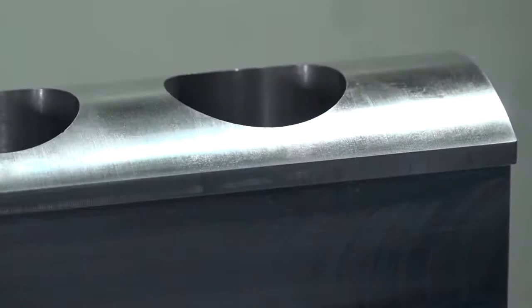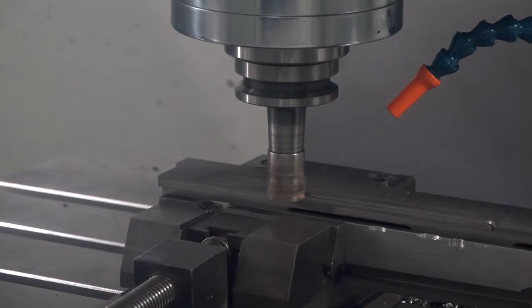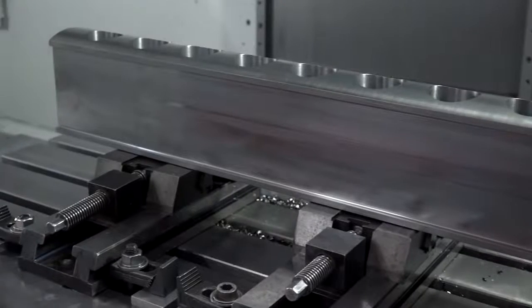And you machine all this from start to finish on here — all the milling and the drilling? That's right. It's very good for drilling. We use a 43mm U-drill and we go through it all in one go — we don't peck it. You go through that in one hit, and that's stainless? Yes, the machine seems to have the power to cope with it.